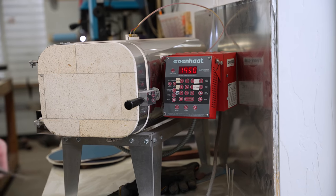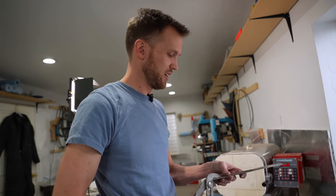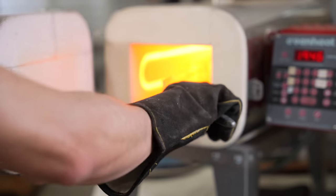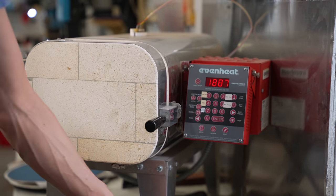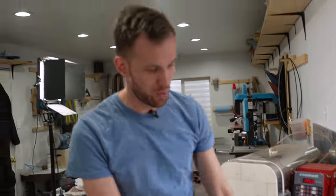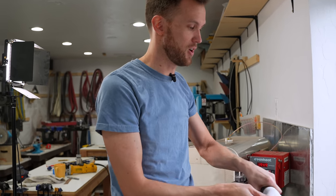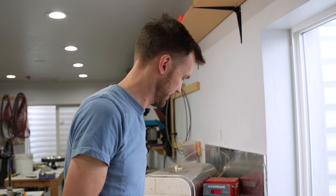Our knife is in the envelope, so now it is time to heat it up. I've got this heating kiln which has been staying nice and hot at 1950 degrees. However when I open it and put the knife in, it's going to lose a lot of heat — maybe as much as 100 degrees — so I'm going to have to let it heat back up to 1950 and then let it run for 20 minutes. It already dropped down to 1900 and it'll probably keep dropping for another minute or so before it starts going back up. After almost 20 minutes, we're going to take it out of the kiln, put it between these metal plates, drop the top plate down, then use a vacuum hose blowing air through a shaped nozzle all over the knife to help it cool down at the right speed — about a minute and a half to two minutes.